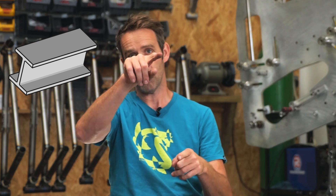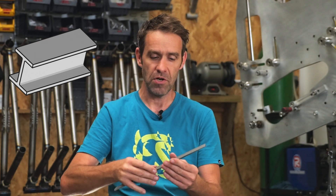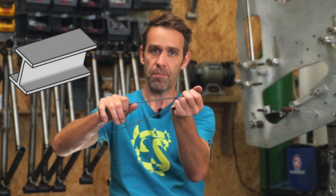You now need to think about the way an I-beam works. I-beams are used in lots of structures — a steel beam with a plate on top, a web across the middle, and a plate across the bottom. The way they work is: by having a web between your two bending beams, you essentially make the whole section bend as one. By doing that, you increase something called the second moment of inertia, which is the parameter used to describe the strength of something in bending.